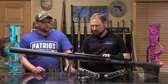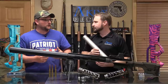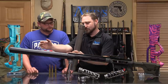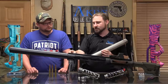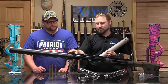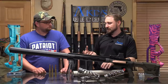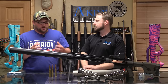So if somebody wanted something like this put on their gun, we're going to pretty much retrofit it for them. They need to be built and fit to each gun — whether you have to turn the barrel on an AR-50, or there's some diameter issue to overcome. It is a drop-in on the 18-inch gun, and on this particular version of the 22-inch which I believe they are now offering. It looks really cool even without the can on it. The longer hand guard lets you use the longer exo rail, which gives you the ability to mount all kinds of night vision and thermals. And it's got that gnarly brake on the end — a very efficient brake which we still utilize in our system.